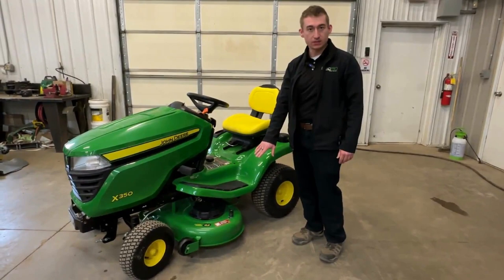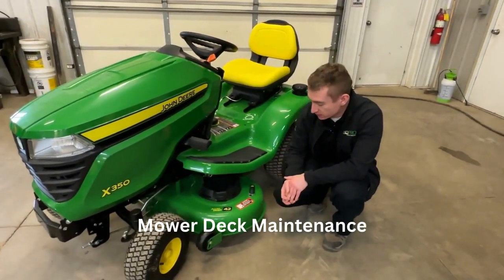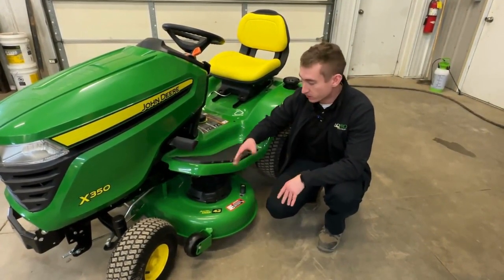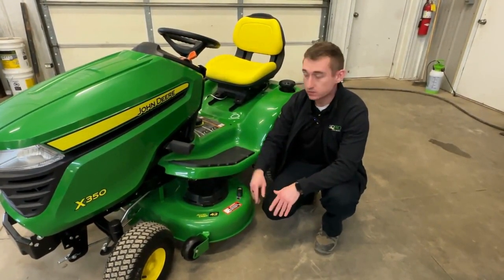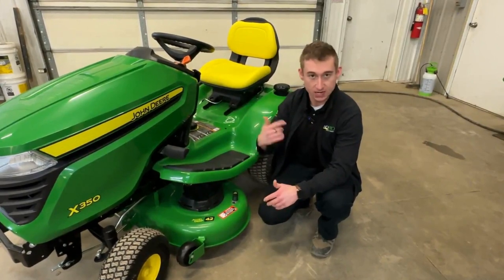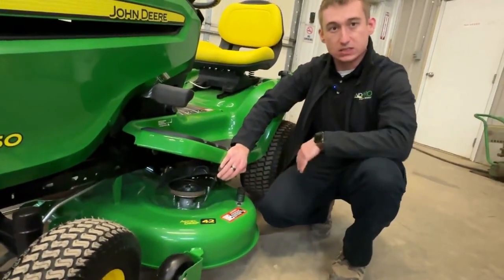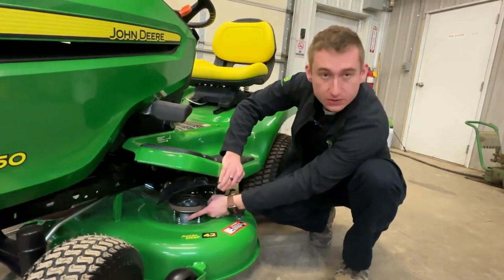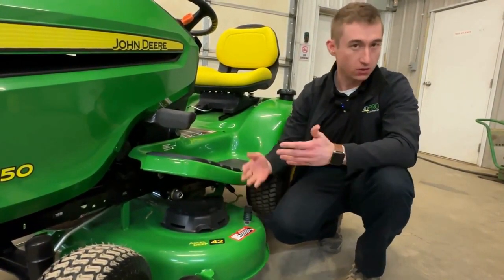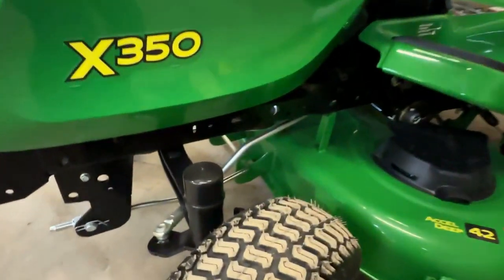Back on the other side, we're going to talk about the deck. One of the most important maintenance features is right here — your hose port, so you can actually clean your deck out. The way you do that is drop the deck to the lowest setting, turn the throttle all the way up, turn your blades on, and that's going to clean your deck out while water runs through it. They've also put caps and covers here to easily get to your spindle for cleaning. The zerk fittings for grease are right on the outside so they're exposed and much easier to access than before. They've also put zerk fittings on the axles back here as well — so again, very easy service and maintenance on these machines.